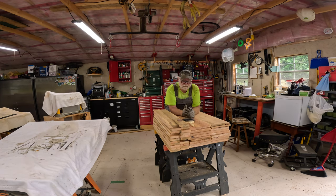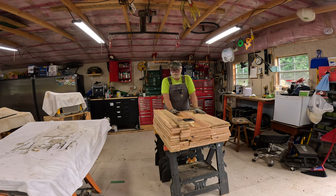So as you know from the start of this video, this is the lumber that came off the front of the house. That's the old siding that I'm going to try to turn into a couple of storage boxes. So this is what I've got so far. I've got a little more recycled pressure treated out in my lumber rack that we're going to use for the runners for the bottom and see if we can put this together. So yeah, it is an awful lot of work. You got to take all the nails out, and it wasn't necessary, but I decided to plane it. I also trimmed the edges, both sides of the boards, so they're going to go together nice and cleanly because I do want the box to be pretty weatherproof. So this is what we've got so far. And I would say that's a pretty good return from the scrap lumber that we had. It was just going to get burned.